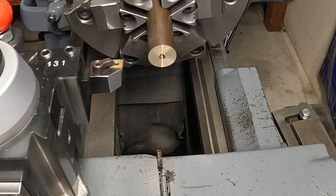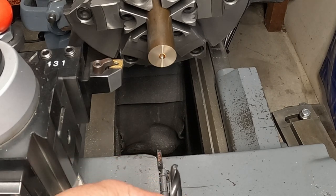Okay, I'll put my 5/16 drill bit in here next. And I only want to go, the ball is going to be about a 1 inch OD, so I want to go in about maybe 3/4 tapped into there.